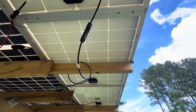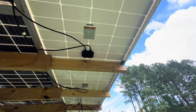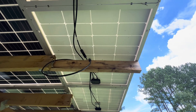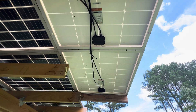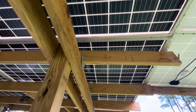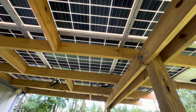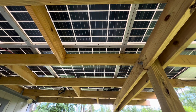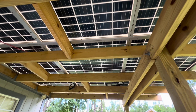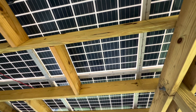These are the solar panels running that system. They're 12 volt solar panels connected positive to negative, positive to negative in series. Right now the sun's not fully out but they're still feeding the system. The solar panels behind those are feeding my inverter inside the garage. I just built a lean-to on the front of my little building — it works great because it helps keep the rain off when I come out here to do something.